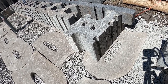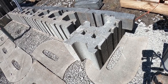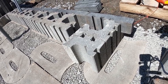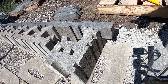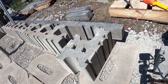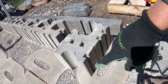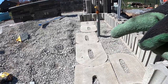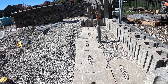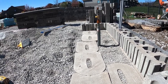So here I decided to be a little more flexible. Instead of setting everything like that's how it has to be, my grill was designed at eight feet outside to outside. Since we're working with these corners like this, we want to be able to tie everything in without cutting. I already had my back wall established, so that's why I went with the back wall first. I got down here to the end, made some adjustments to what would be closest to the 8 foot, and I added 2.5 inches. Now we'll go down this row as we turn the corner, and we'll get a gauge for where that ends. We can then make our fridge opening and only cut on one side. That's the beauty of this system, reducing cuts, waste, and time.